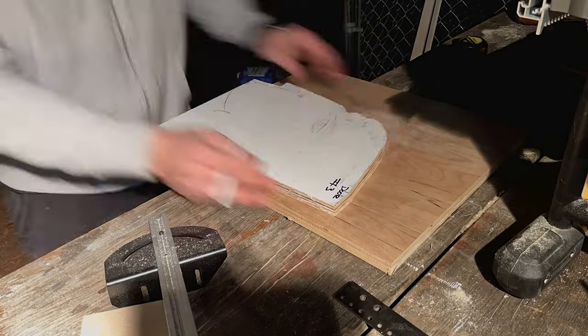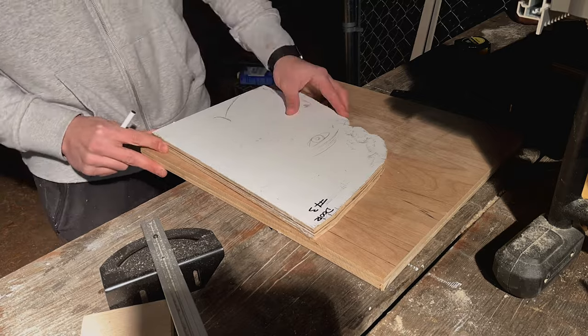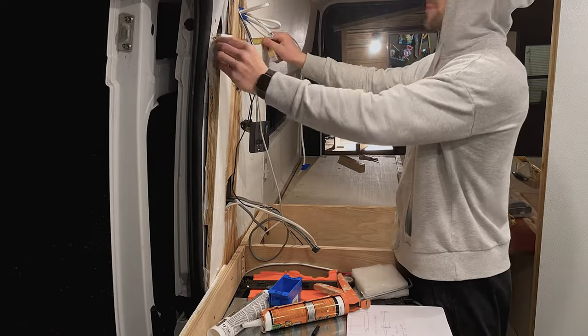Tonight we are finishing the final cabinet for the van. We've already worked on the one over this window, the one on the opposite side of the shower, and an hour working on our kitchen one, which is a little more complicated because we have a really weird contour from the van. So it's irregular — it's not just a wall and then an angle and another wall or ceiling. If you're doing this, it's incredibly difficult, especially if you've never done it before. So get a jigsaw, get a contour gauge, take some measures with a tape measure, and basically find out the spacing for the one by twos.